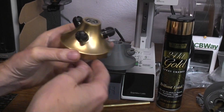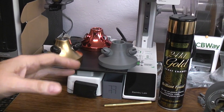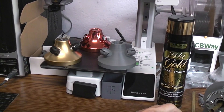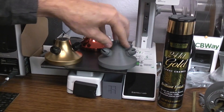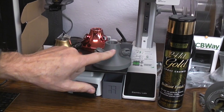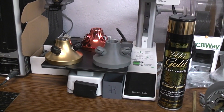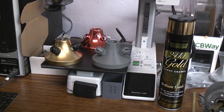Just to show you it can be done without too much work — minimal sanding — it was just two light coats. I misted the first one on, let it sit for about 15–20 minutes, then misted the second one on. I found this on Amazon and it came the next day. So if you have a 3D print that doesn't have a lot of critical shapes and angles — just nice big slopes and curves — brushing on UV resin liquid is the way to go to fill in all those gaps and sand it really easily.